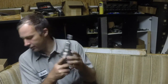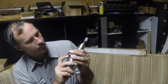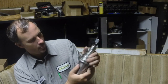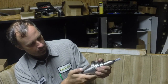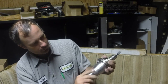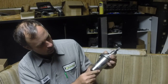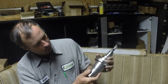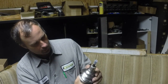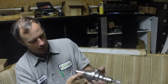This one and all the rest of those — only have ones that are Gühring. These are Schunk — I guess that's how you say that. I think they're also German. They've been in and out of the machine several times, but they've still got a good taper on them. They're not nicked up or banged up, and they still tighten up good and the bores look excellent. So I think this will be good tooling.